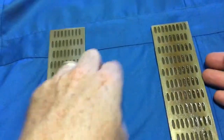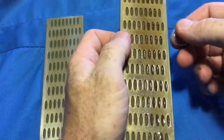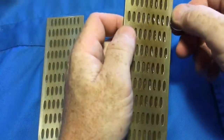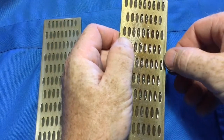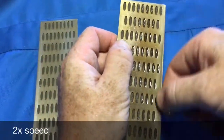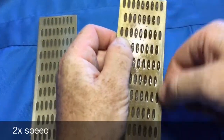Take the lens in your fingers and hold it at a roughly 45 degree angle to the grinding surface. Keep your wrist stationary and swing your hand in an arc backwards and forwards along the grinding surface, and count the number of repetitions. Once done, rotate the lens a small amount and repeat. I'm doing six sets of up and down, and doing the same number of repetitions means you will create a similar amount of bevel each time.